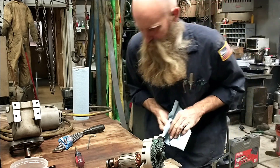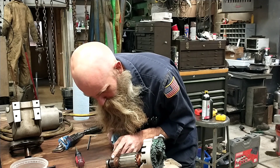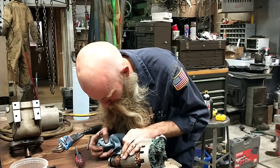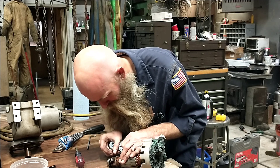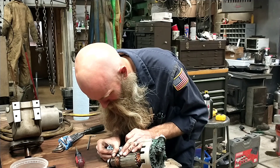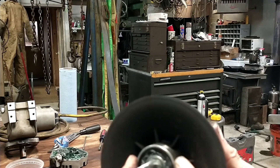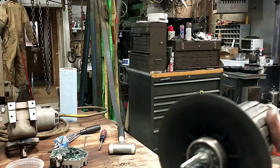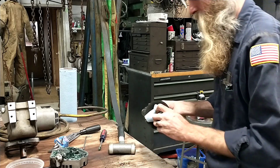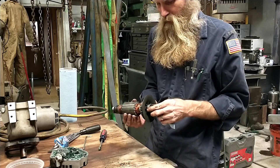This is probably about the last round for this one. I can see I had turned more off it last time than I remembered — she needs a pretty good turning job this time. I'll get it figured out how to get it apart and bring you guys back. It was just this bearing with a snug fit into the housing on top — I just had to tap it out. I'm going to clean this bearing out and repack it while I'm at it. We're ready to get this set up in the lathe and turn this commutator.